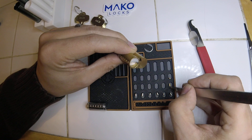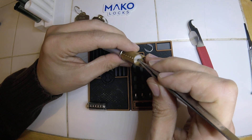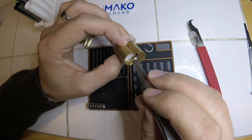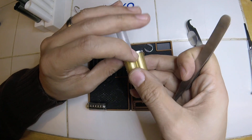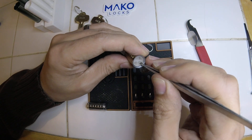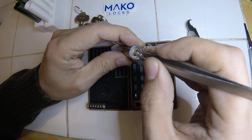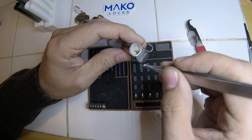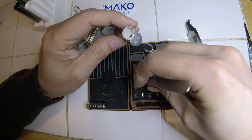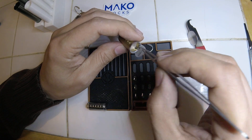Sometimes you want to keep track of which side faces the key pin. You're going to want to take out the springs if you want to be able to remove the control sleeve. I'll just do it from this side to remove them a bit faster. The only trouble is that if you let them fly out, you might mix up the order of which is the top or the bottom pin. So that's a T-pin - that was on the top, the control pin.